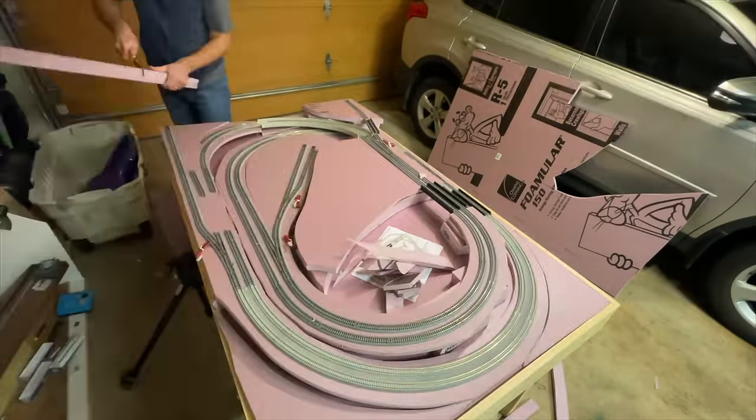Wiring is fairly straightforward, but you do have to make sure you don't connect a wire to the wrong terminal. First, I connected all the wires from the push button turnout controls to a long terminal strip, and then I added another terminal strip to connect wires from the DCC bus to, and then from there to the DS64 units. This way, if I needed to remove one of those two units, I wouldn't have to worry about any solder joints, and all I had to do was remove the wires from those terminal strips. Then it was a matter of connecting the two wires from each turnout motor to one of the four pairs of connection points on each DS64 unit.